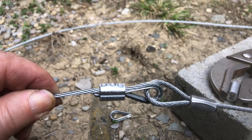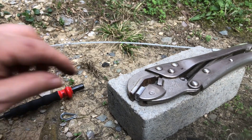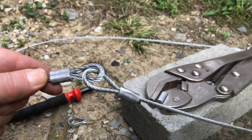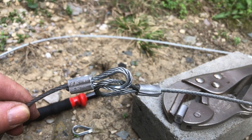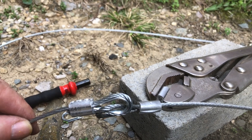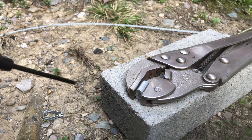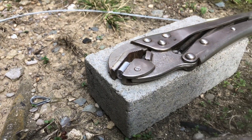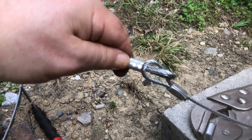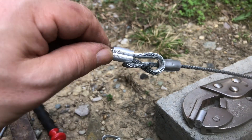As you can see, it's very easy. You punch with the hammer and the ferrule needs to be at the bottom of the grip so that it rests on the concrete. At the end, you can see that you are getting a very nice grip. The sleeve does not expand on the side because it's completely blocked by the grip. You do the punches on both sides — they said it's between two and three, so I put two on one side and three on the other. And I can tell you, it's not moving anymore.